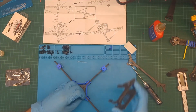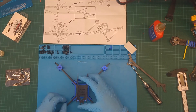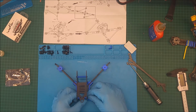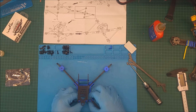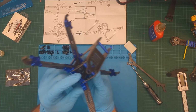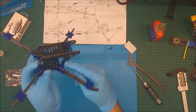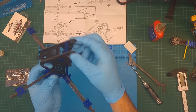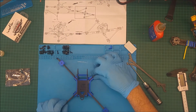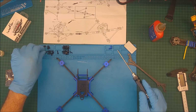seems like, put it inside here. Okay, so it goes inside the carbon and inside the aluminum. That's it. So if you can see here, the part goes inside the carbon and the aluminum. So if you take only 2 screws, you have this movement that you can fix your board or mount your board. So the screw needed here is 3x6. So that screw here.